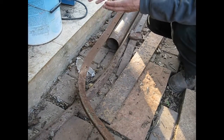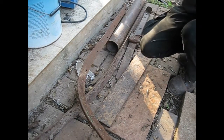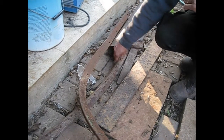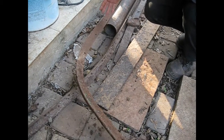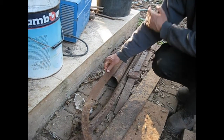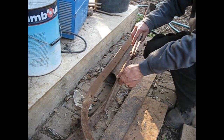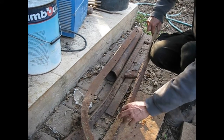These are the materials I intend to use to make the stand — the feet, the legs, whatever you want to call it — of the anvil. All of these, just like the materials I used on the anvil, are recycled materials. These angle irons were used for a fence, probably around 50 years in the field. Here we have a piece of pipe, 8 millimeters thick. The angle irons are about 7 to 8 millimeters thick. I also have flat stock around 10 millimeters thick for brackets, and 10 to 12 millimeters thick material to make the feet.